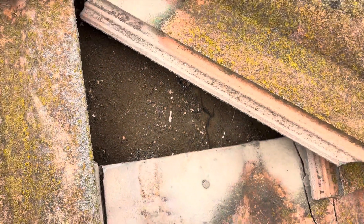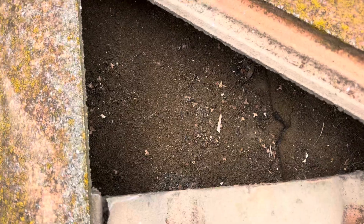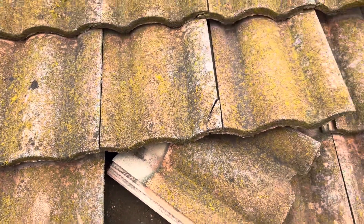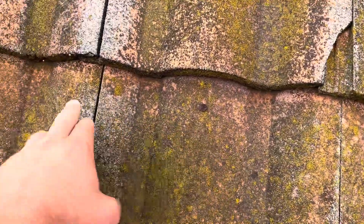There's deterioration and dirtiness — that is our waterproofing membrane that has expired. What causes real concern is all these tiles are nailed in right here with nails that are exposed.